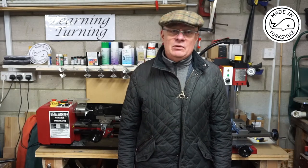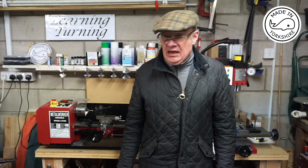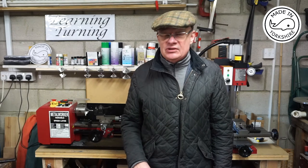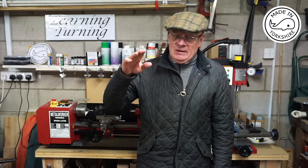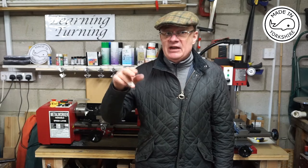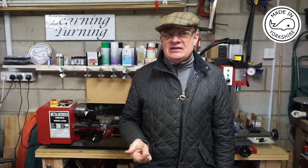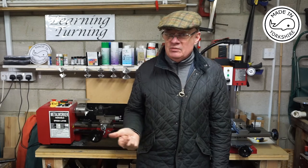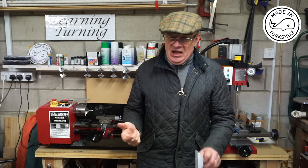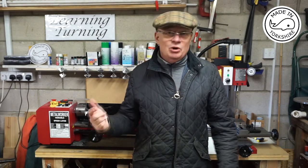Hi there. The other week when I was parting a piece of metal on the mini-lathe, I had a sort of not very pleasant experience. The parting tool sort of got underneath the piece I was trying to part off. It was towards the end of the cut, and having investigated on the internet, I think one of the problems is the amount of give you might have in the various components.